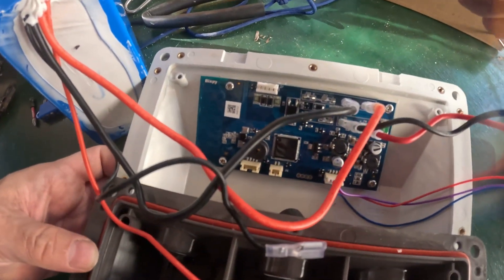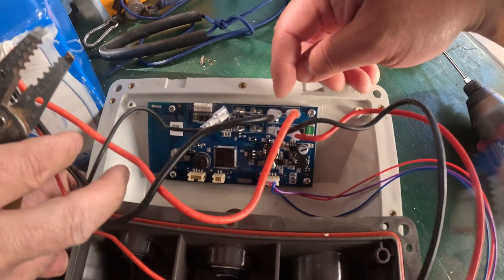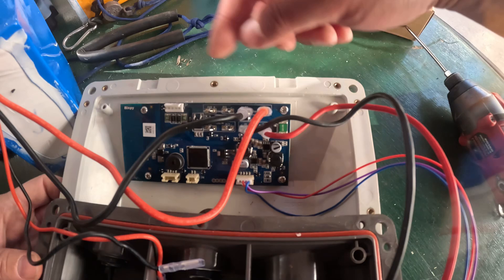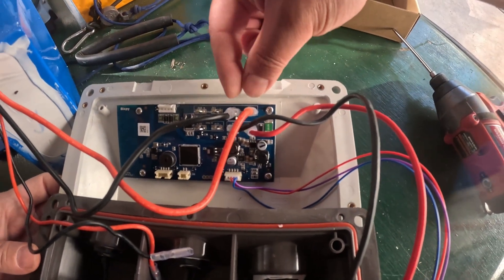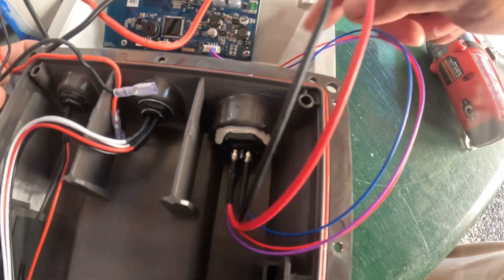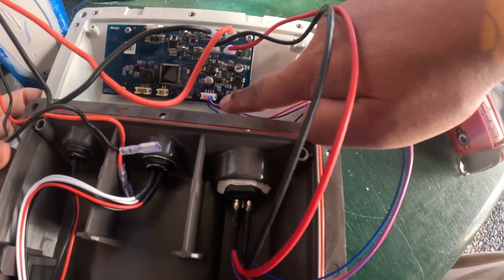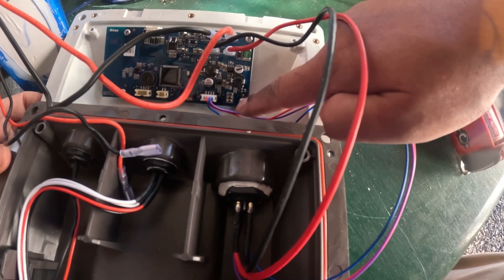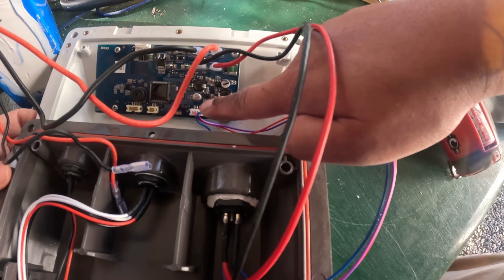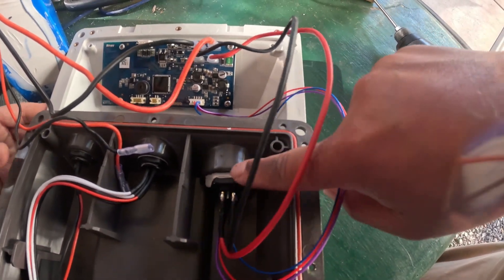So when you do this, we just start unplugging. The thick wire goes to J2 and J3 — that's the power. This row is actually discharging the power, and these two cables go to the motor connector right here. This is most likely the current and power control to adjust the motor speed — that's what this board does.